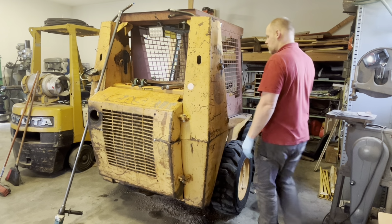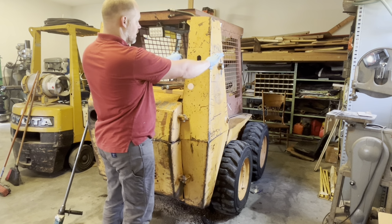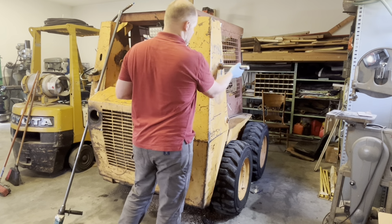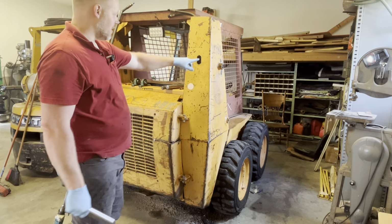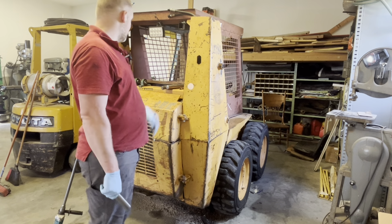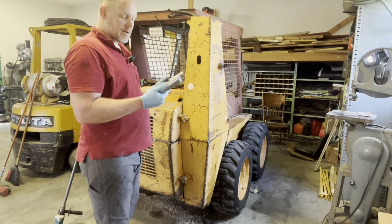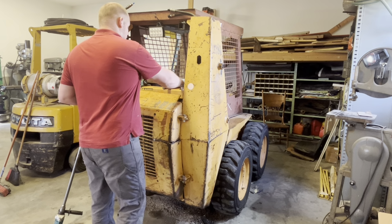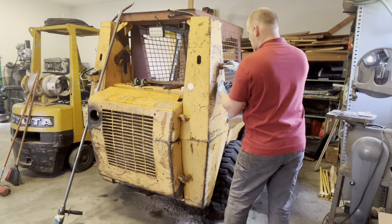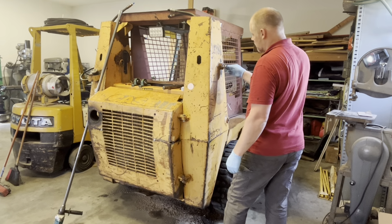Now in the other video I showed you, there's a bushing here and a bushing here, and they were out of alignment. The pin wouldn't go through. So line boring resolves that because it makes everything in a line. I line bored it, and then I used the finish hone and took the last few thousandths. Made two of these out of 4140. They are a very snug fit. This is a 2/1000 fit, clearance fit.